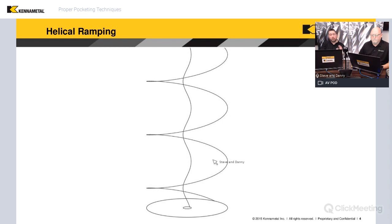The main thing to remember: everybody thinks about the outside of the path when calculating the ramp angle and forgets the inside of that path. You have to move back in your arc to figure out where the inside is actually cutting and take that into account when you figure out your ramp. This is very common. Like we talked about with chip thinning, so often people have a bad experience, break a tool, and back off disproportionately. Knowing this will help you dial in the most optimum setup.